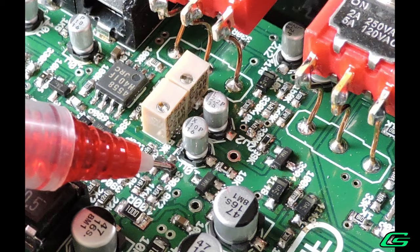There is no bill of materials provided, also known as a BOM, for the surface mount version, that is. The PCB does not provide component references that tie them back to the schematic. Normally, this doesn't stop you from stuffing the board, except the PCB doesn't indicate diode polarity. The spaces are just too tight for all that.